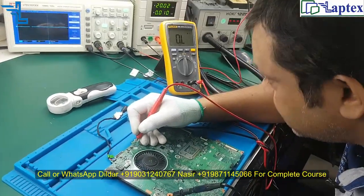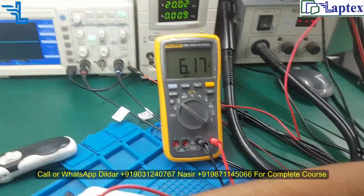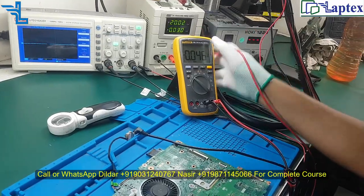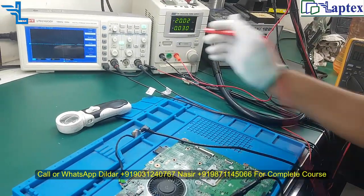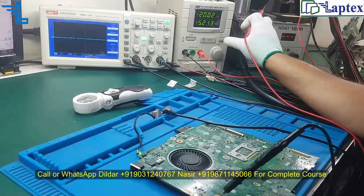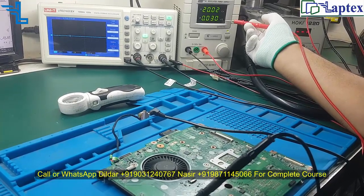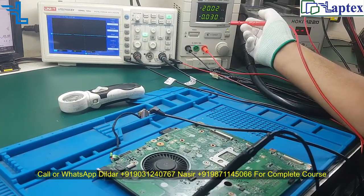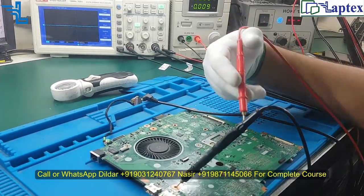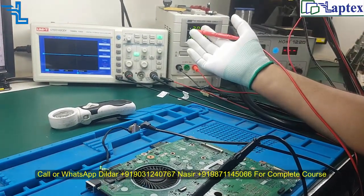Now you check, it is 6 volt. Okay, now you see that I turn it on, and in the actual condition you would understand that after taking the load of 0.030 amp, it is taking the load and it is going down. What does it indicate? It indicates that your motherboard has started into the suspend form.